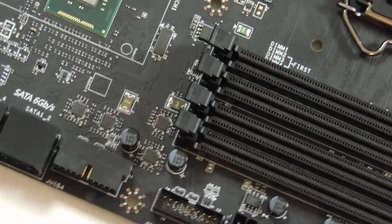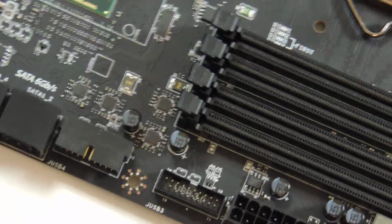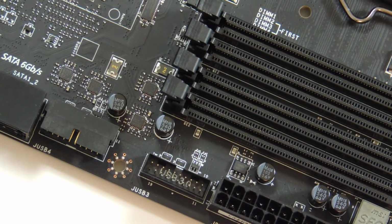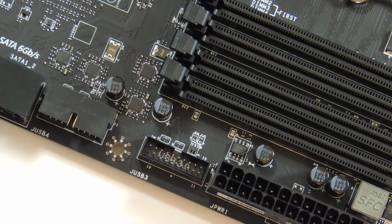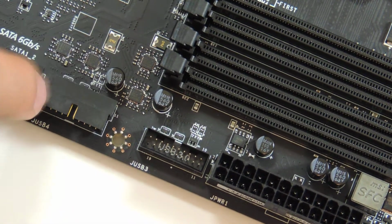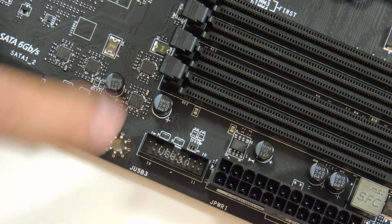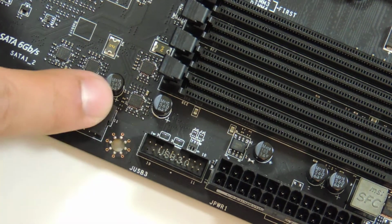Moving along, oh, here we got some goodies. These are USB 3.0 internal headers. Notice the right angle header. This right angle header is from Lotes, and it's quite a pricey part. So let's let it float. So this is the Lotes. Lotes is, I think, one of the only, if not the only, company that makes this header right-angled. There's also a non-right-angled one, so you can pick or choose or use both.